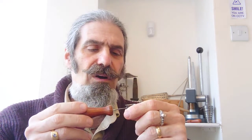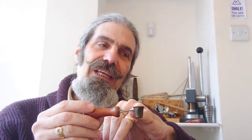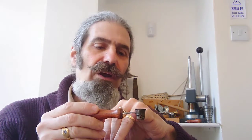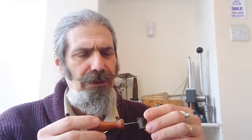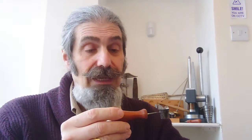So I used silver solder instead. I use silver solder all the time — I'm a silversmith and goldsmith by profession, so that's just another day of the week for me. Silver solder gives a bond that won't melt until you're well over 700 degrees Celsius. We're talking blowtorch temperatures, not just a candle flame which would be a few hundred degrees — easily hot enough to melt electrical solder but nowhere near the temperature necessary to melt silver solder.